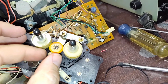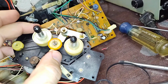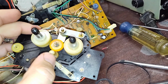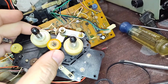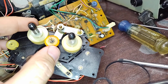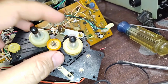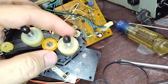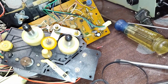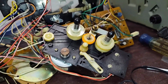So you can check this by rocking the hub back and forth here, and you can check on how easy it is to turn. In one direction it'll turn the hub one way, in the other direction the other way. It has really good grip. It shouldn't be slipping. If you want to put a little bit of drag on this, see how easy it is to stop. This one's not easy to stop, which is good. Opposite direction, grips really well. So the idler portion in this sense is done, and that grips really well.